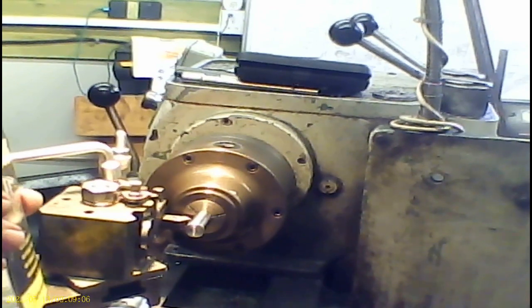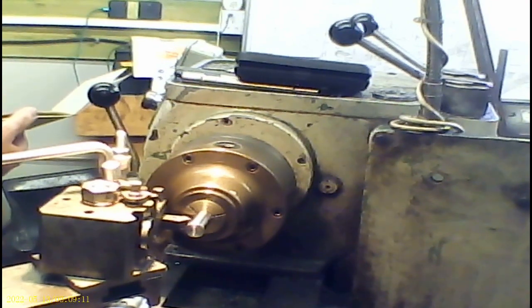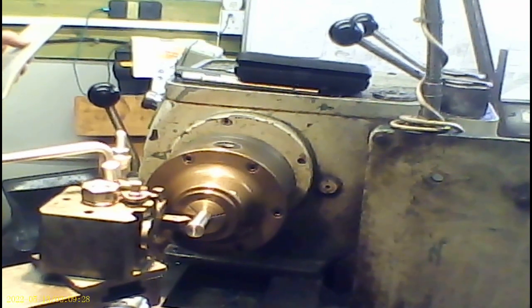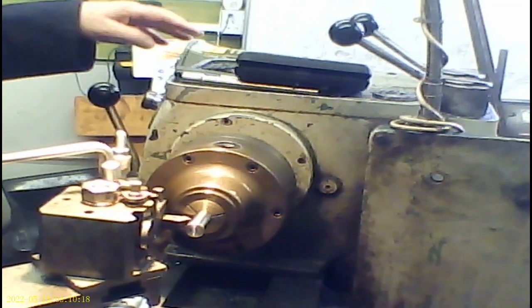I'm going to the old favourite, Zeus. I can just check on that, and it will tell me that for British Standard Whitworth threads, 5/8 Whitworth, the core diameter is 0.5086 and the depth of thread is 0.0582. Now put 0.0582 into millimeters: 1.47 millimeters. So let's say 1.5 millimeters, and that will give me more or less what I want.